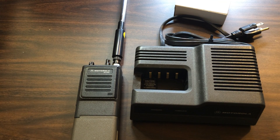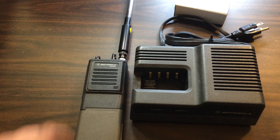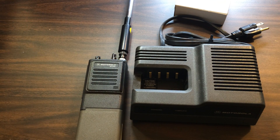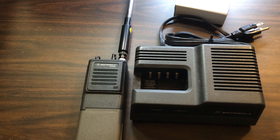They're not that hard to find on eBay. Right after I bought this one, the seller put up another one for auction, and there were some when I looked at old completed listings. They're not that uncommon, but there are multiple band splits — this radio comes in other versions including one that will cover the two meter band entirely, and those are pretty inexpensive, even around 20 to 30 bucks. The big thing with these is they need to be programmed by a computer, and if you don't have the equipment to do it yourself, you're looking at 15 to 20 bucks to get someone else to reprogram it. That's an extra cost, so you've got to think through the frequencies you want, especially since you only get six channels.